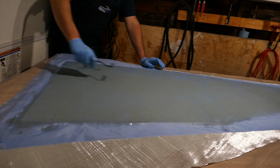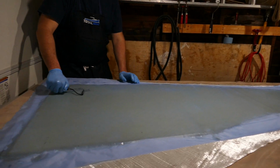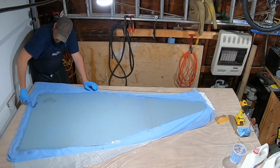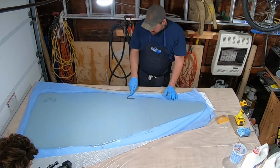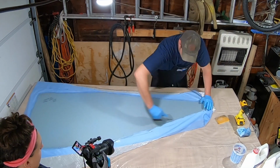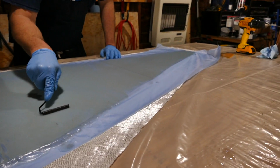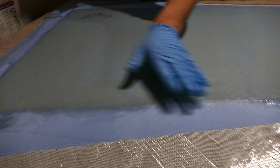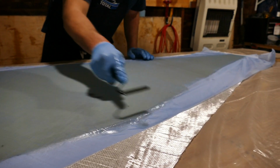And we noticed that because the foam is so porous, bubbles do develop over time that weren't there 5 seconds ago. Yeah, so in a few minutes you might see bubbles pop up, and I'll probably go over this again. Again, rolling it in between every layer, if you have the time, really does help quite a bit when it comes to this part, because a lot of the bubbles are already gone. And again, you can just gently, I'm not pushing down, I'm basically just rubbing my hands against the top, and it pulls the wrinkles right out of that peel ply for you.